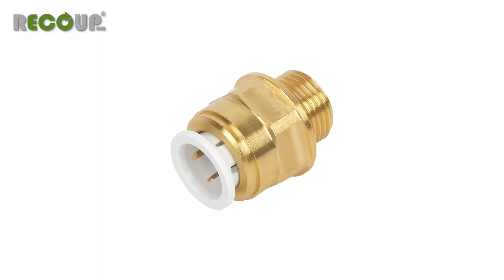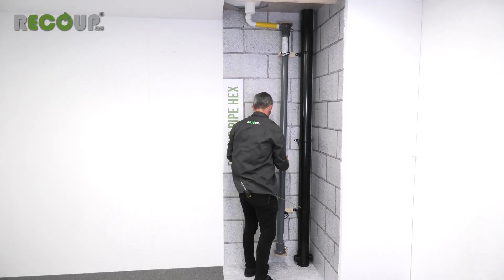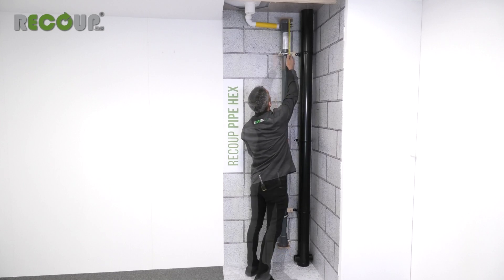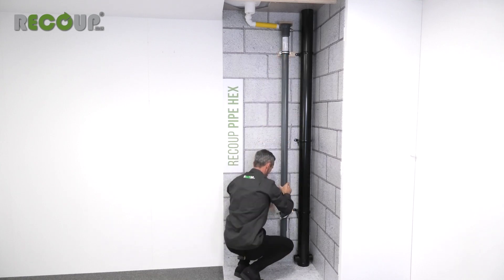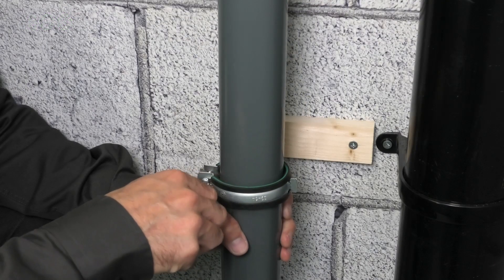Using push-fit half-inch male iron BSP connectors can help prevent over-tightening of the threaded connector when connecting pipework. With the mounting brackets in the open position and the cardboard end protector still in place, lift the Pipe Hex into location, being careful not to drop or hit the unit on the floor or surroundings. Raise the unit so 300mm is extending past the top bracket and tighten the mounting bracket screws.